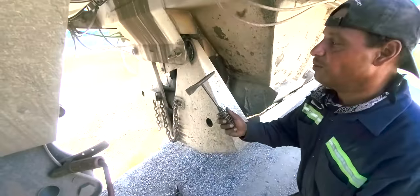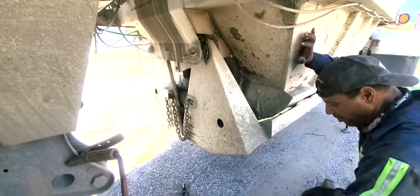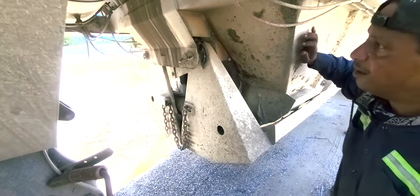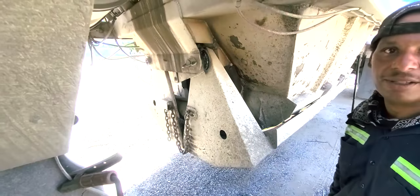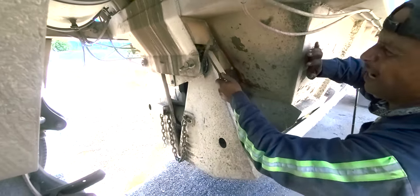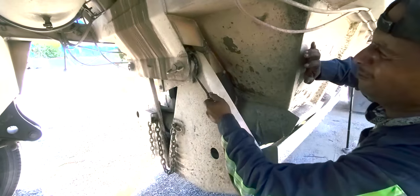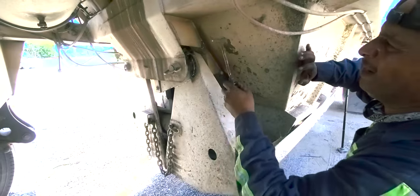This is a tool we use that takes off the excess of the weld. So I'm going to show you right now. If you don't clean this stuff off, when you put the 7018 on there, it's not going to stick right. So we're going to clean this off. See how the excess is falling off? Got to get all that excess off.